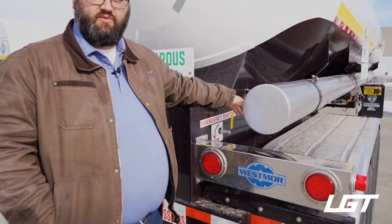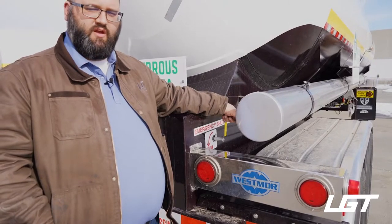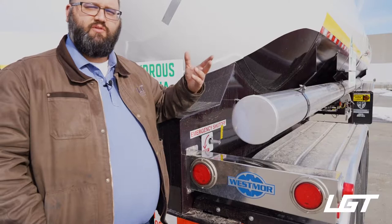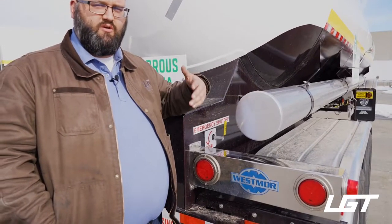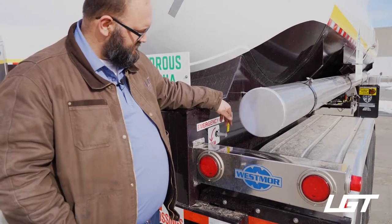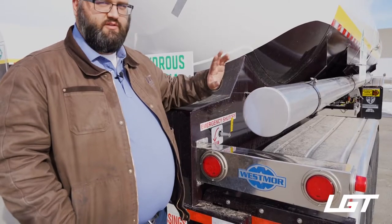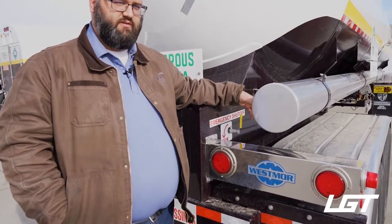So the internal valves we were just describing run on air. So when the air pressure gets there, you can use the air pressure to flip a switch, and that will activate that brake chamber to open the valve. So how do you stop that? You decrease the pressure of the air going to the valve. And that's exactly what this does. It's a 90 degree turn. It's very simple. You turn that, it evacuates all the air from the trailer. There's a valve in here that goes down, and it's basically just a little dump valve.